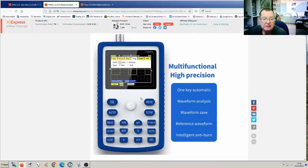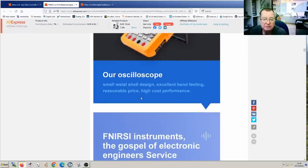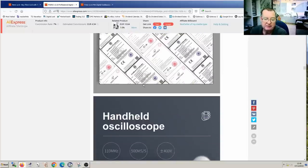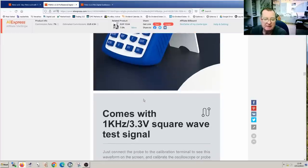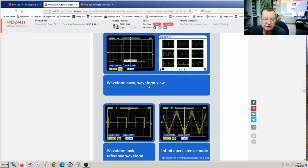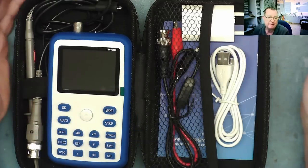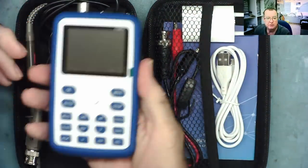Firmware can be upgraded. This is a single channel oscilloscope, but it's also a handheld oscilloscope, so this is ideal for when you're working on site. It's also ideal for working on things like switch mode power supplies where there are high voltages present, because the oscilloscope is isolated from the mains — up to 400 volt measuring voltage. It has a test signal built in, and it's a low-cost oscilloscope with 110 megahertz bandwidth, isolated so we can use it on high voltage equipment.